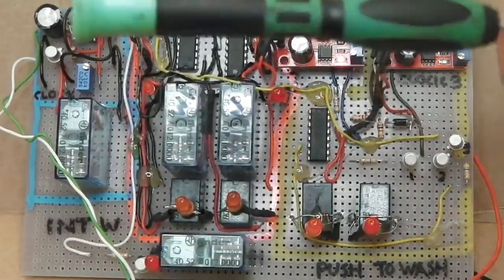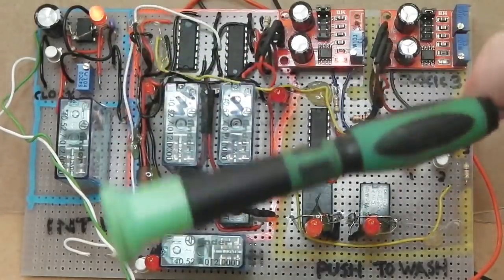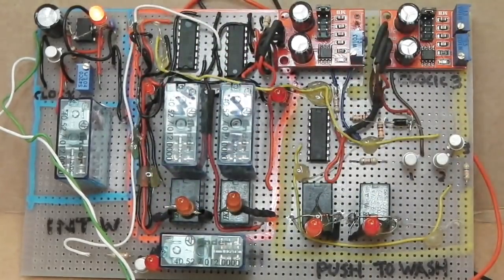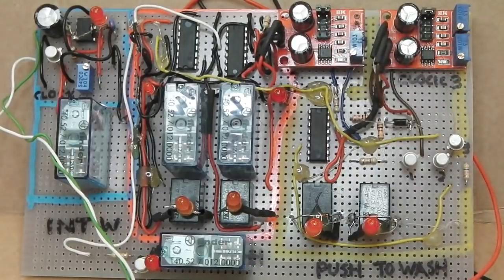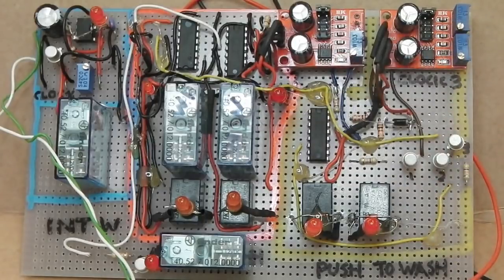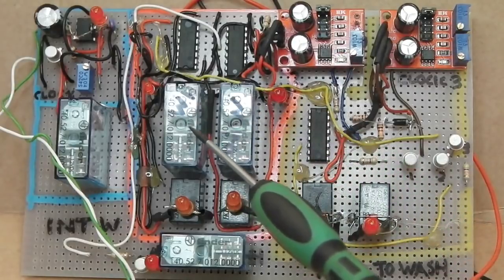And if it is raining, if it needs to clean the screen, the rain sensing pad will pick up and wash the screen wet. It may be that when you pull the stalk down and hit the washer jet goes up and the rain sensors don't see that and don't actually come on. That's where the rest of the program comes in. If the rain sensors don't see the washer jets for whatever reason, because they are particular about the droplet pattern, this system will go through a process of doing two squirts of water, which is preheated, by the way, because we've got a hot wash system on this. So preheated hot water gets squirted to the window twice, and at the same time it wipes the window. Then it waits about 6 seconds and it gives a dry wipe at the end.